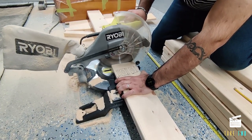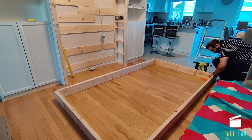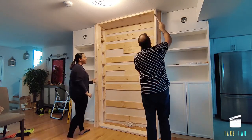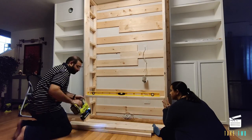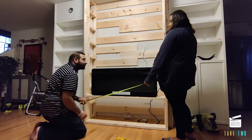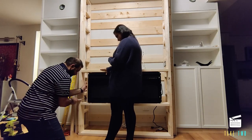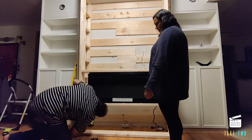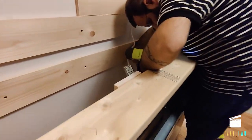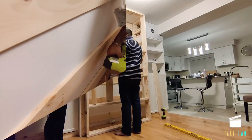Then we started with the middle frame. We used two by six wood, cut it into pieces, laid them out on the floor, and built them together. Once the main frame was done we put it in place just to check if it would fit, then used levelers to put in the shelves for the fireplace. We made sure the fireplace is 18 inches above the floor level, and added supports on the side and on the back so it is secured. The reason for using two by sixes was that the fireplace width was five inches and we wanted a very strong frame for the fireplace and the TV.